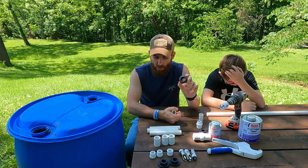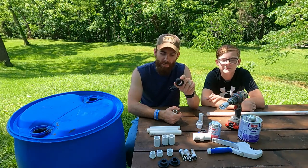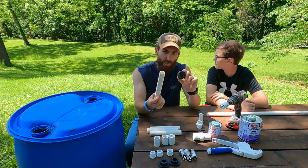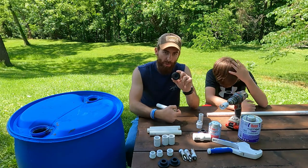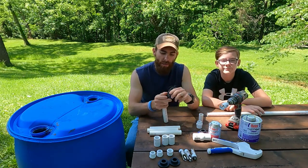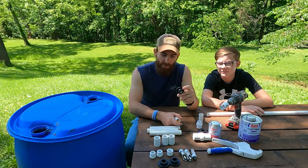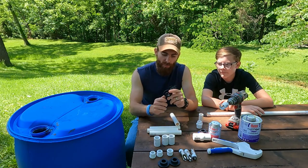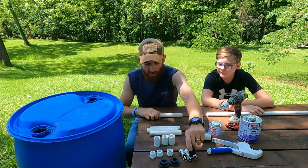So these Uniseal, I picked these up off of Amazon. I'll leave a link down in the description below. These are the 3/4 size for a 3/4 piece of pipe to go through. So this hole in the middle is 3/4, but you need an 1¼-inch hole saw for this outer ring to press through. So it'll be a tight fit, it'll push in and pop into place, and then there's like a little ridge on this that'll hold it in place until you push that pipe through. So that's what this is.